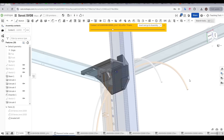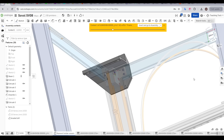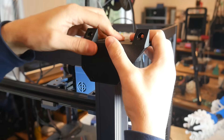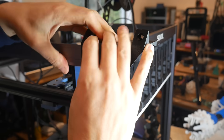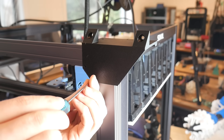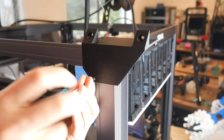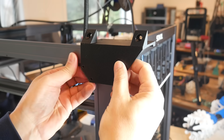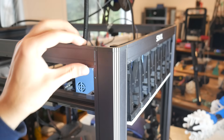The final components are mounting brackets on each end, largely designed in context of the main assembly so I could match up mounting holes and add channels to fit nicely onto the extrusions. Because of this, they are a pretty snug fit — you need to line up the channel on top, then flex the part down until it snaps satisfyingly into position. I also designed in holes for M3 bolts to go through and further secure it to the frame, though the part is still easy to remove if required.